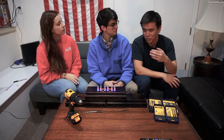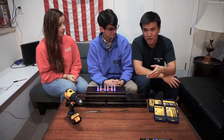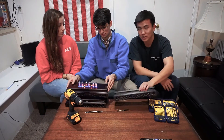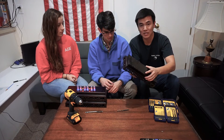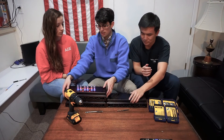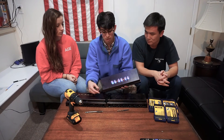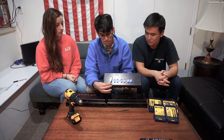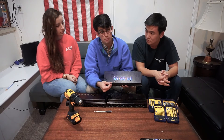At the end of our antiquing journey, I insisted that we drop by this Chinese antique store, and what we found were these stands that are hollow on the inside and fairly thin between the top and the bottom, which means it's very easy to drill through. All of the Nixie tubes — both the big ones and the little ones — are standard sizes. For the big ones I used a 3/4 inch wood spade, and for the little tubes a 1/4 inch drill bit.